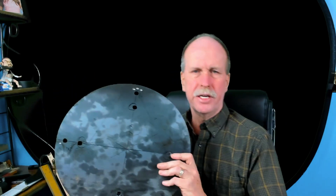This will be the plate for the table stand, and this will be the lower plate. Right here you will see the holes — these inner ones here — this is where it will attach to the base of the table. Now with the three dots up here, this is going to be the north; south will have two dots; east will have a dot to the right of the center line; and west will have a dot to the left of the east-west line. Now this is ready for installation, but before we do that, I'm going to take the second plate and put it underneath this plate, then use these holes — the north, south, east, west holes — as a template, and drill through them to the next plate. That way I know that they'll match up.